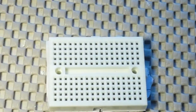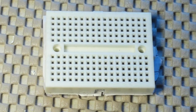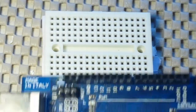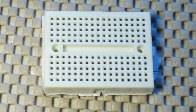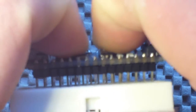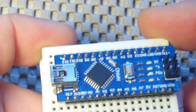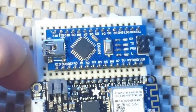This is a little mini breadboard, but you'll get the idea — all these breadboards have the 0.1-inch pin spacing. If we take a look at the Mega — and the Uno is the same way — I don't want to say they're not breadboard-friendly because they are, but you'll have to use jumper wires to connect things up. However, the Nano and the Feather are breadboard-friendly in the sense that once you solder on the headers, you can plug them directly into a breadboard like that, which makes them very convenient to use.